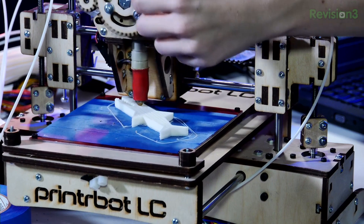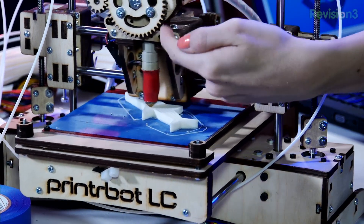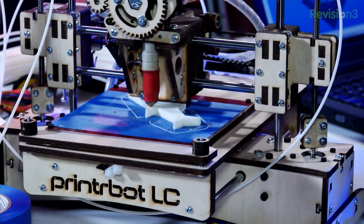You also want to make sure that the gears on the front are moving when it's supposed to be printing. Every time it's moving around you can see it's working. You want to make sure that works every single time. Next up, you want to check that your filament isn't getting caught somewhere. Maybe check the sizing in Repeatier and make sure that if it is 3mm filament you actually have it set to 3mm in the software.